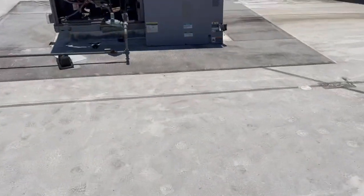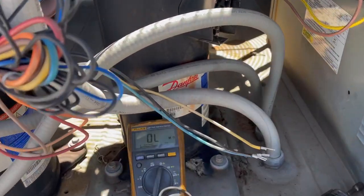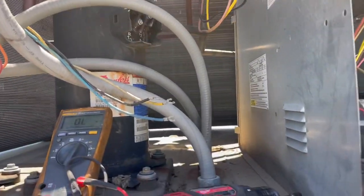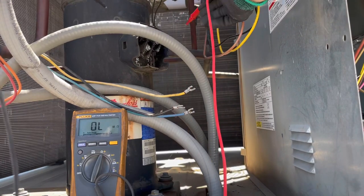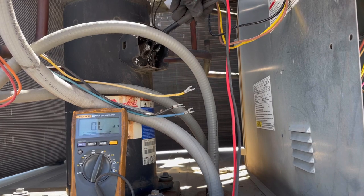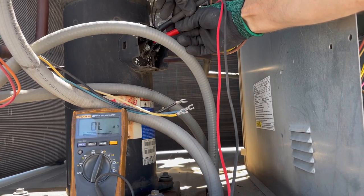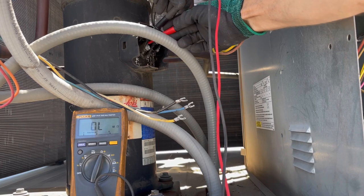You might say, why don't you try to start it up and see if that's the case? Well, we can do that — it'll trip the breaker. Now I'll go to this other one that I know is running and check the exact same things. Wires disconnected, doing the same thing. Touch ground — there's a copper bare ground, you'll see that little spike for a second, but see how it's gone. That's good. Check between the legs: 2.6, 2.6, 2.6. That one's definitely normal.